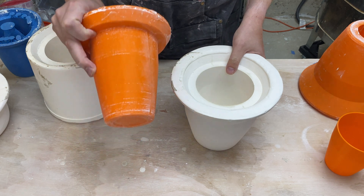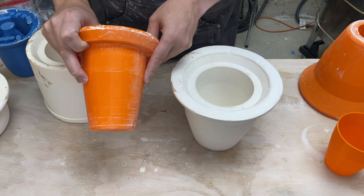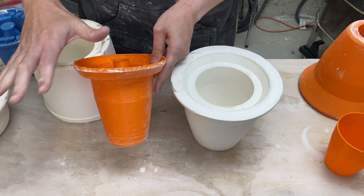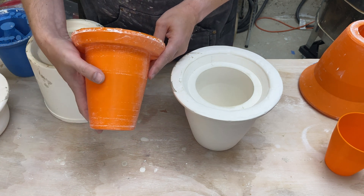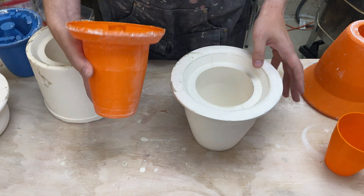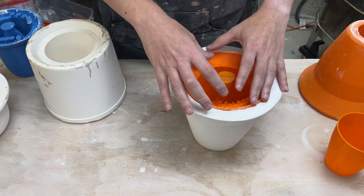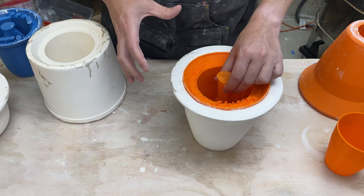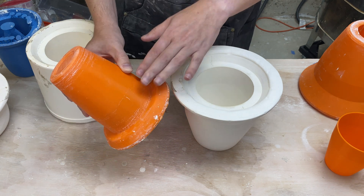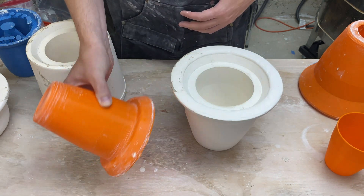The first option is to change the 3D print itself — in particular to make it a little bit thinner. I went with an arbitrary value so it's relatively rigid, but if I made it thinner I'd get a couple of advantages: it would print faster, and since it's printed on a high quality setting it's relatively slow. The idea is that thinner walls would flex more, so I could bend it a bit while it's embedded in the plaster and pull it out more easily. The trade-off is I want it stiff enough to hold back the plaster.